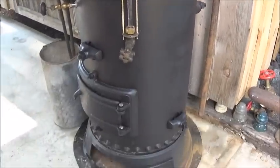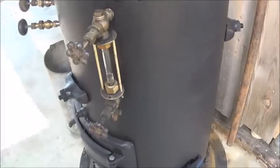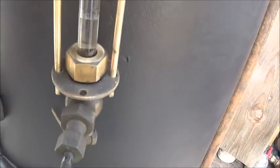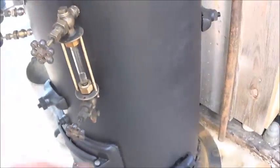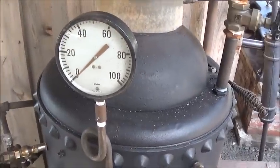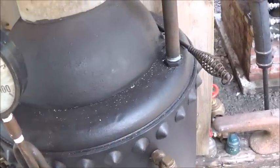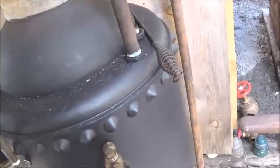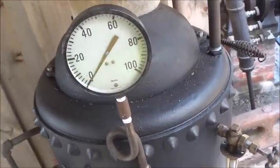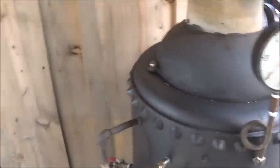And we was just playing anyway, so checking things out. I like the little boiler. It's really, really nice. We got our water level good for the next time. So when we fire it, it'll expand back. Our new gauge worked really well. I did run it up to 85 for the blow off. I like to do that usually at least once, just to make sure this working correctly. And I can see the gauge a lot better.